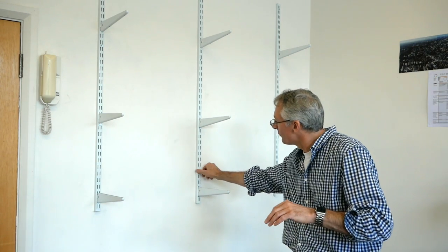One of the things we're going to do is use a nice three-quarter inch, 18mm birch ply for the shelving. We're leaving the cut edges exposed but just putting a slight profile on it to soften it down a little bit. We'll have a wax finish to give it a nice handle and a nice feel. I'll notch it around the uprights so the shelves sit nicely into the wall.